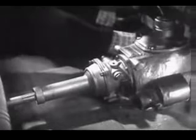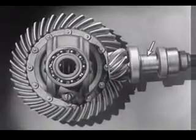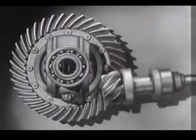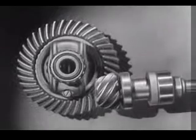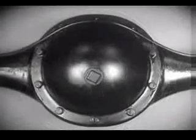A shaft in the middle of the floor of an automobile would be inconvenient for passengers and would be awkward for carrying luggage. Today, engineers have found a way to make the car roomier and closer to the road without a clumsy shaft above the floor. The drive shaft from the engine to the differential is lowered out of the way, and the drive shaft is connected to the rear axle at the bottom. The new low center drive makes the rear axle quieter, stronger, and more durable because it gives better, smoother contact between the gears.